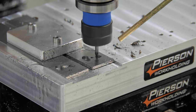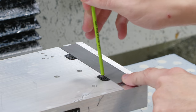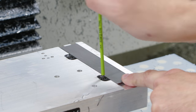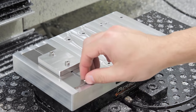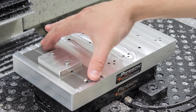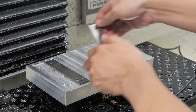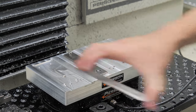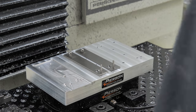In the first op, I'm using a clamp I made to hold down the steel. This was to put less bend in them than pit bulls would. Later, I added a screw to make the blades even flatter. I decided to standardize all my fixtures to 8-32 threads. But I didn't think about how I'd end up using different drivers. I think I should just add another tab to the blade so I can just use 2 matching screws.